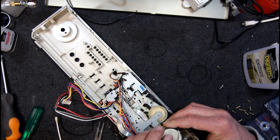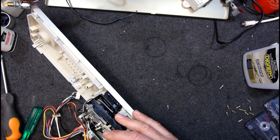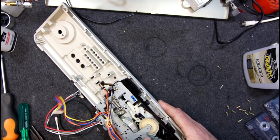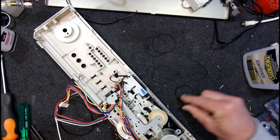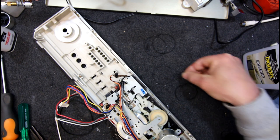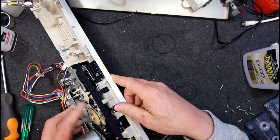I'm in position. And that's quite loose — so much for my little thing on the top there. I wonder if that's still too big. We are on the motor pulley but we're on where the flat belt is meant to go. So that's going to make it a little looser — yeah, that's a bit too loose. I can see it bulging up when I turn it. Definitely too big. I guess we have to go to one of these smaller ones. I've got something in between — I guess that's a bit too much of a jump. That might be what I want — that's the intermediate one. Get it on the lower pulley. That's the one I think.